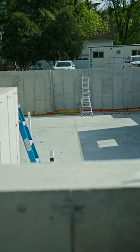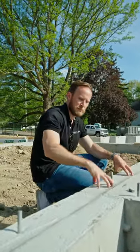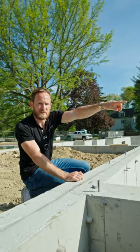That line will be used to pull parallel off to a line here on our foundation as well as the back. So when this plate is installed, we know that it will be exactly parallel with the plate on the opposite side of the home.